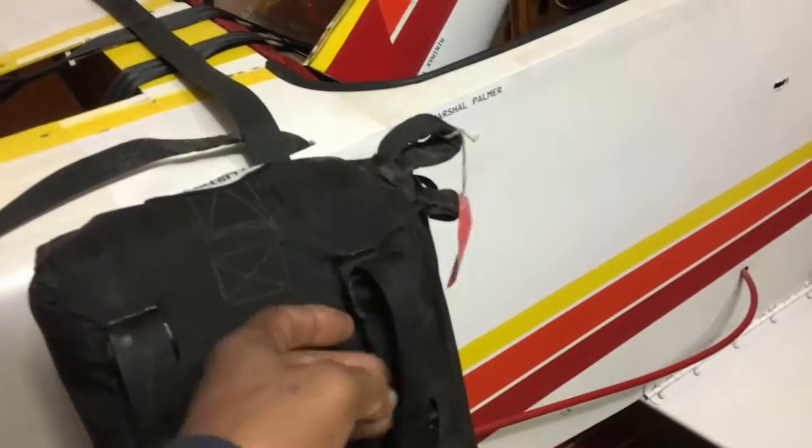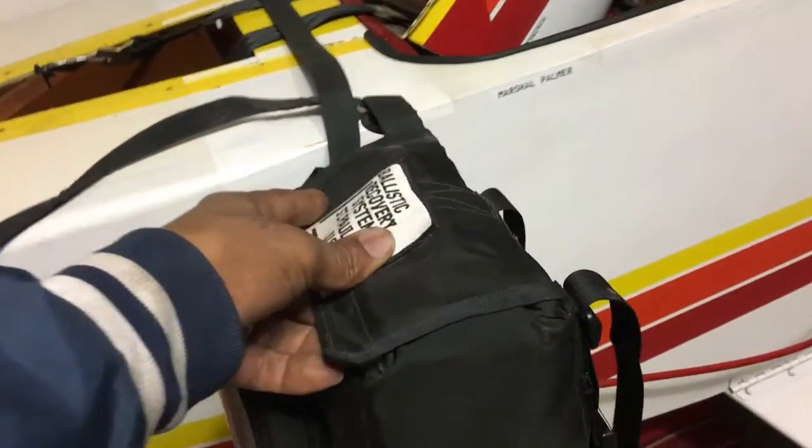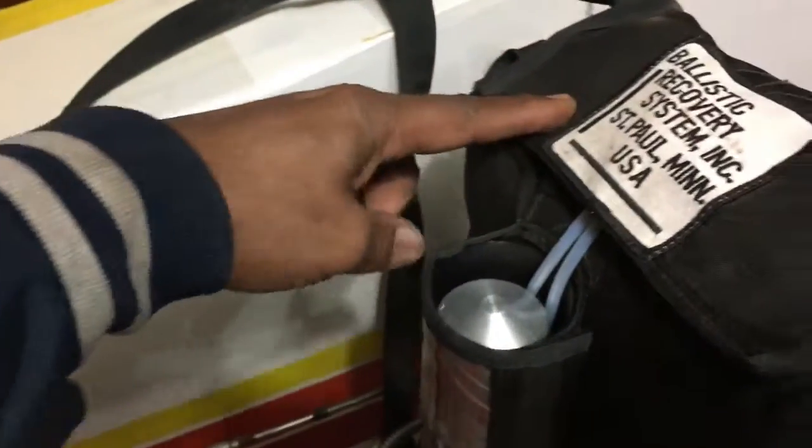They mount to the cross members inside the fuselage. You can see these. They're gonna strap in. It's gonna sit in, kind of like so, and the rocket part is gonna come up through the fabric. I'm gonna make a little hatch where I can have the access for that rocket to come out, and it's gonna have a flap that just covers over that. Again, I'm gonna have to cut out an access port and then put a frame around it so the fabric won't lose its tension right here.